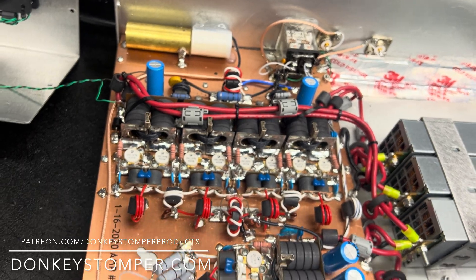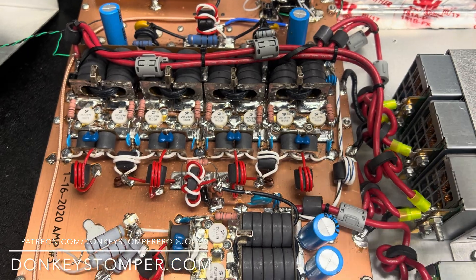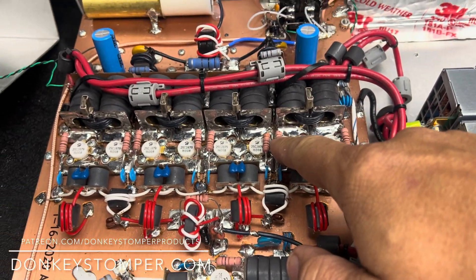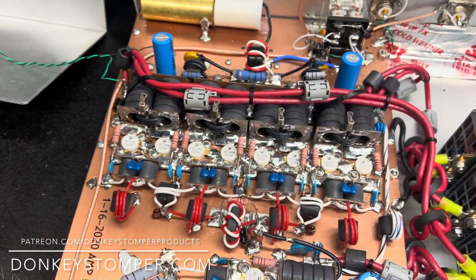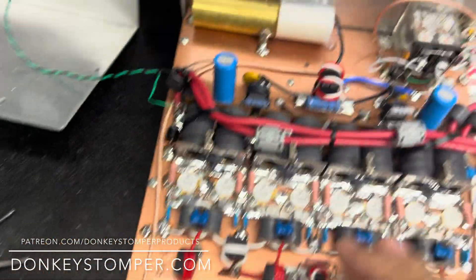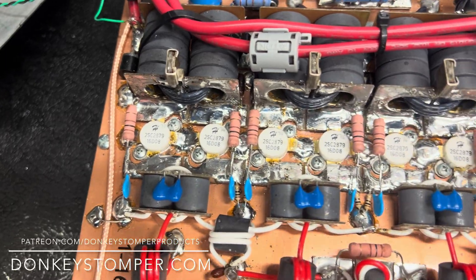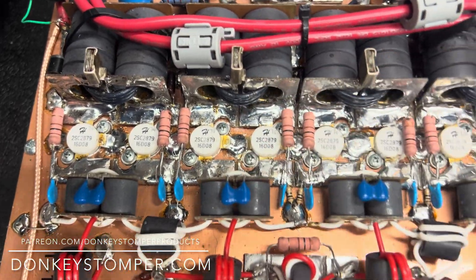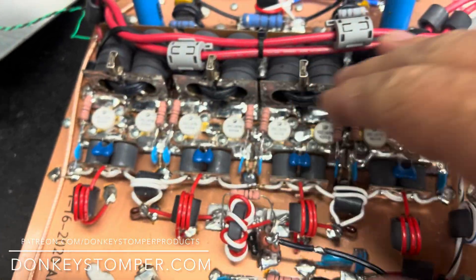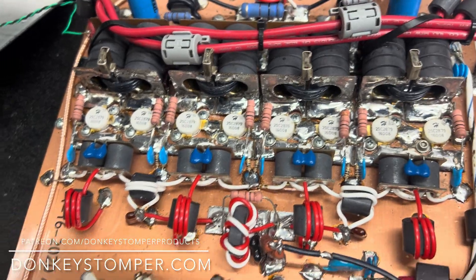So I got my thermal imager out and started watching it on the FLIR. This pill and this pill, this resistor and this resistor were getting hotter than fire. But it wasn't actually those two pills causing it. I re-soldered all the transistors — I didn't put them in originally, somebody else did — but I re-soldered them all, cleaned it up. It's not perfect but it's a lot cleaner than it was. When I did the tenums I cleaned it up the best I could; there's a bit too much solder on there, which doesn't hurt operation, but I had to clean them off to work on it.